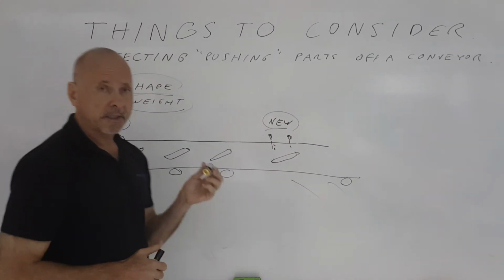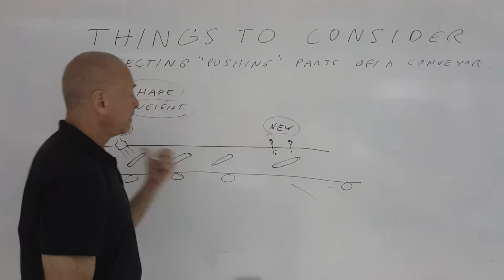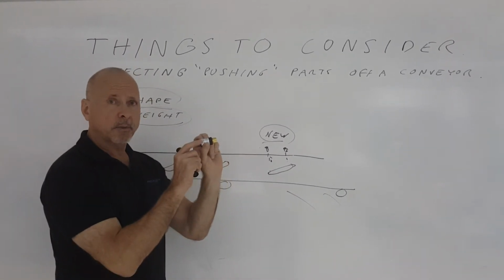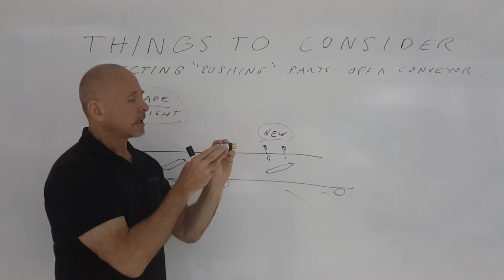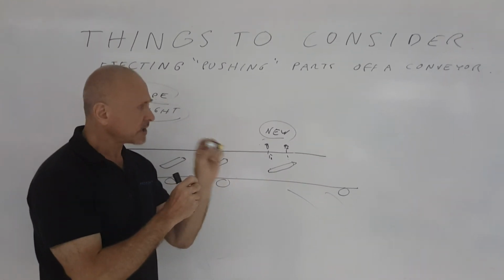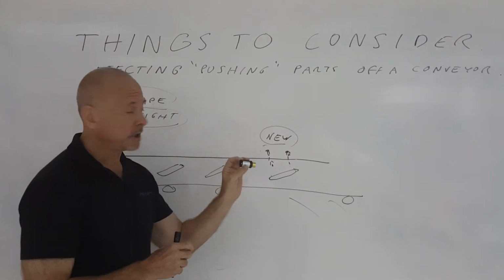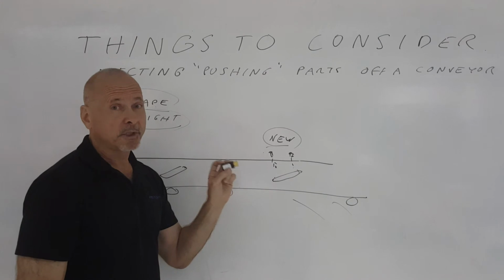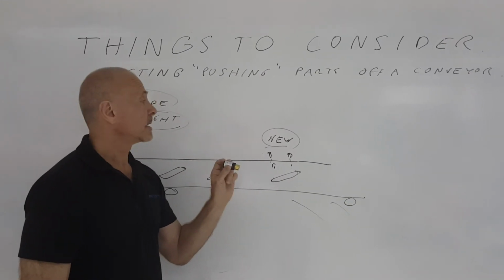Also, the amount of compressed air was about the same, even though they had only one item before, because the air jet being adjustable, you can cut back on the force and the air consumption just enough to blow this material off. And because the material was fairly light, you didn't need all that much force, nor all that much air consumption.